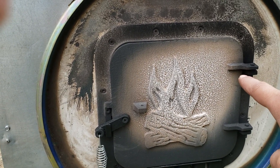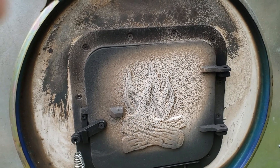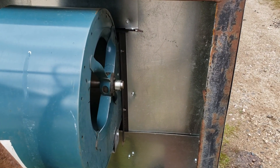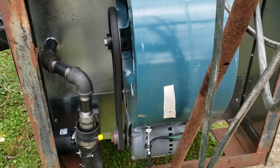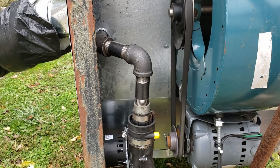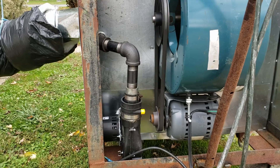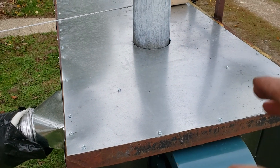The other side of this black iron pipe comes over here, goes 90 degrees, and goes all the way back to a draft inducer — that's where I'm forcing my air through. Just a squirrel cage blower I had, just pushing cold air in. If you wanted to be more efficient, you could put a return duct down here and run that back into your house, just like your furnace. Right here is my draft inducer — that's just off of a water heater — and that's what's forcing air into the firebox. You've got to have a lot of air and oxygen being pushed in there, because if you just put oil in a pan and light it, it's not real eventful. You've got to make it really turbulent. This blower blows on the backside of the 55 gallon drum, hits the backside, and makes it just swirl around in there really nice.